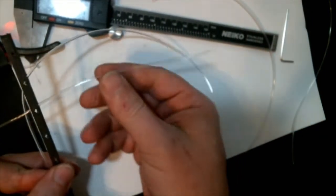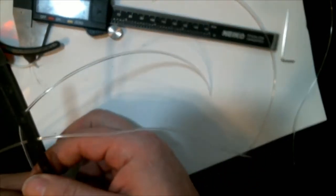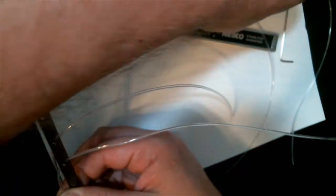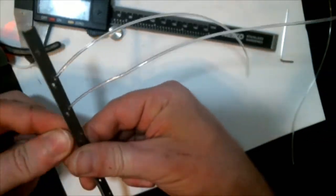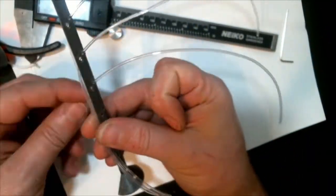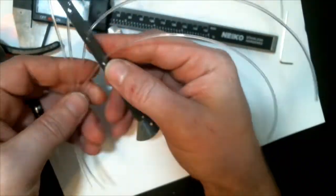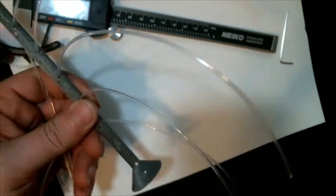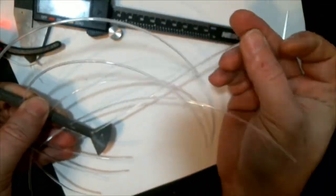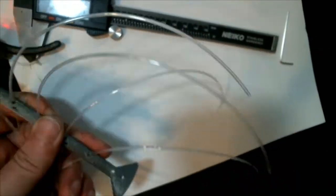This is something I would change and do differently if I did this project again. I would probably use NeoPixel strips instead of the fiber optics, because as you saw, as the light gets further and further away, it gets dimmer and dimmer. On top of that, if you kink the fiber optics, which this shouldn't, because the holes that I put in there are at an angle, so it shouldn't kink them, but it still dims a lot by the time you're reaching the end.